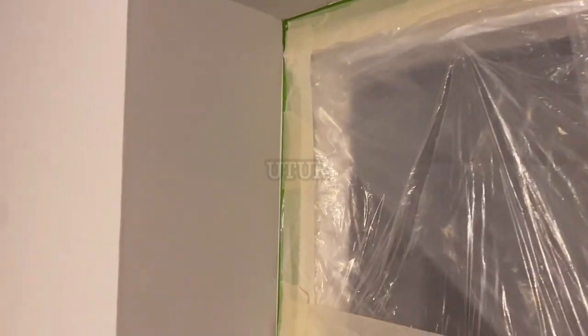I've covered up the window stool with polythene and frog tape to prevent overspray from paint latching onto the window stool - if paint spills onto it you may need to repaint it. Make sure you've prepped your window area and covered all the nooks and crannies, and wherever you've got any opening make sure you tape it over with frog tape or masking tape. Shut the window when you're masking, and when you're done masking leave the window slightly ajar. If the covering isn't very sturdy, reinforce the polythene until you're sure the covering can withstand the wind to a certain degree. When ventilating, don't open all your windows - just leave them slightly ajar.